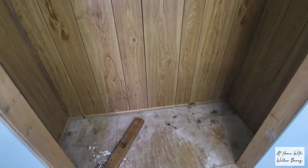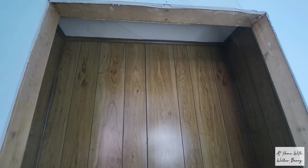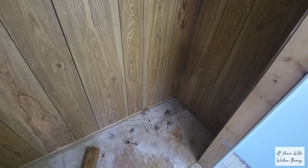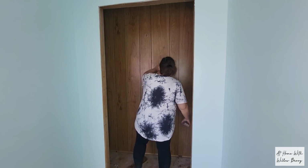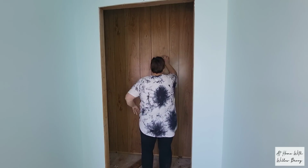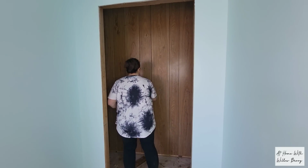We will eventually be painting the closet in a pure ultra white with a satin finish, but today we're focusing on sanding and priming the walls here in the closet. There is a sheen on the paneling, and we want to scuff it up to remove that sheen to prevent the paint from peeling off. Tim is in charge of putting the room back together, such as replacing the subfloors and painting the walls, but sanding the walls is something I can do.